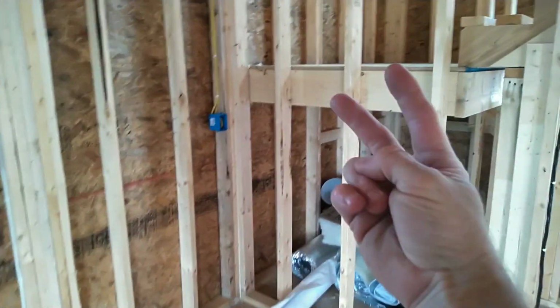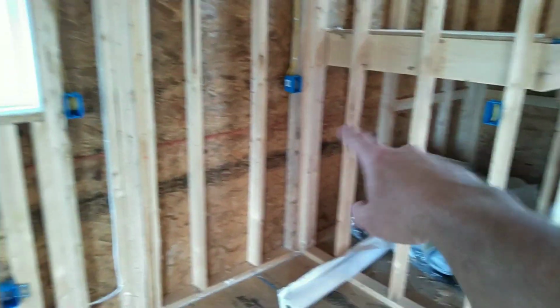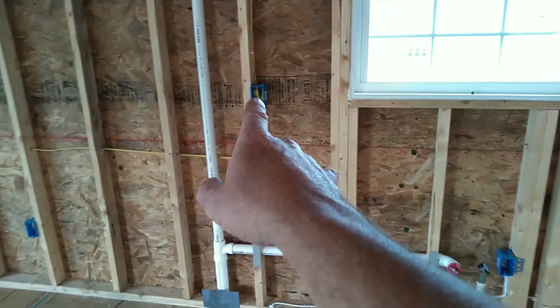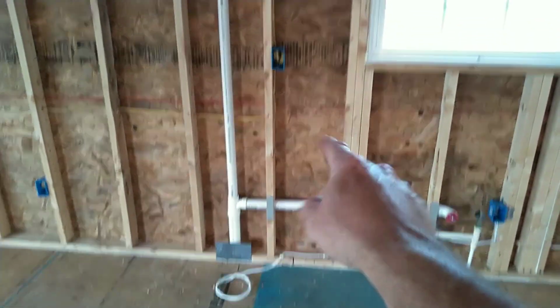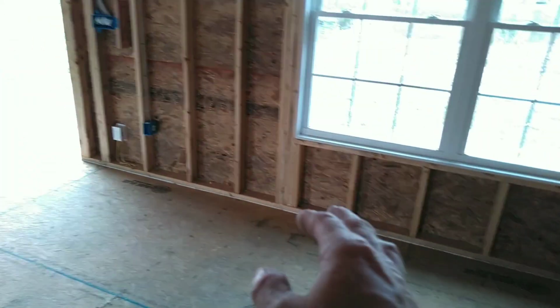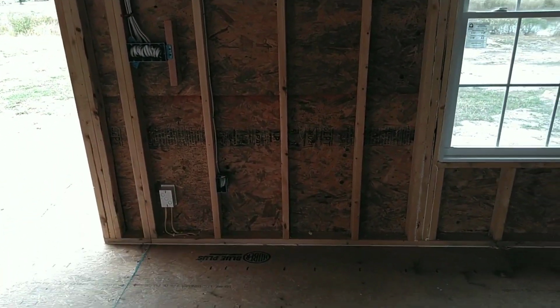But the other kitchen counter circuit, because you have to have two kitchen counter circuits. This is the other kitchen counter circuit. It's spaced 4 foot apart, and I got another one there which was within 4 foot apart. And then I've got one that serves this side of the kitchen counter, just on the other side of the sink. And pantry will go here, and this outlet and this outlet are within 12 feet apart. This outlet falls on the living room side.